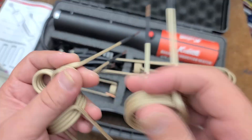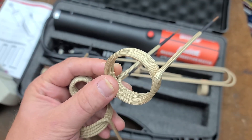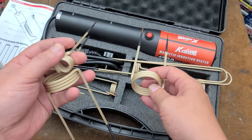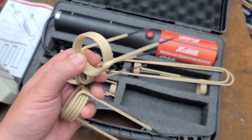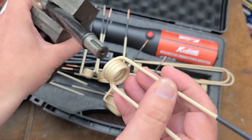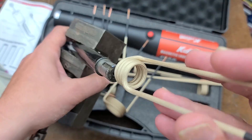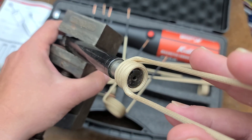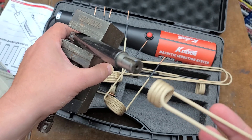They do give you several wires. This is a 2.5 millimeter or 14 gauge wire with a Nomex or fiberglass fireproofing on it, which also provides insulation because you do need the coil. What these are is just a high-frequency switching power supply. And what it's doing is it's turning these little coils essentially into one side of a transformer. The other side of the transformer is whatever you're heating up.